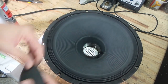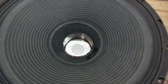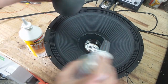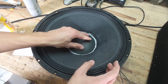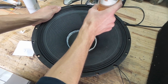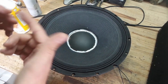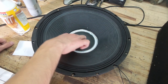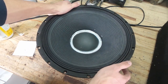We are going to need to re-glue this in place, or else it's going to sound terrible once it's in the enclosure. On the whole it does seem to have done something, so I'm going to re-glue this just with wood glue. Just before you glue it on, give it one last quick blow to make sure there's really nothing in there. Obviously this isn't the best way to do it, but we're just trying to do what we can. I'm going to apply another layer of glue — this is going to act like a resin to seal off any holes or leaks. I probably wouldn't recommend doing this on higher frequency speakers, but since this is a woofer and it's already quite heavy, I don't think a little extra glue will make a huge difference. I'll leave it to dry for a couple of hours.